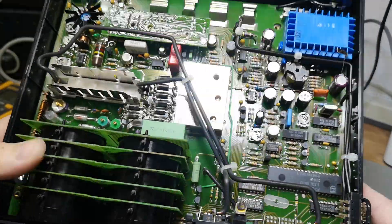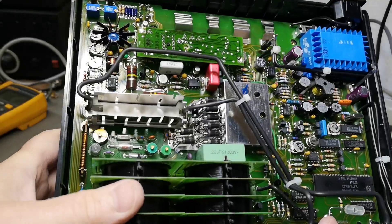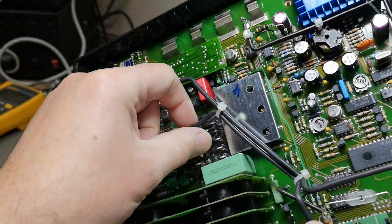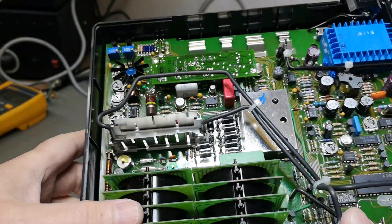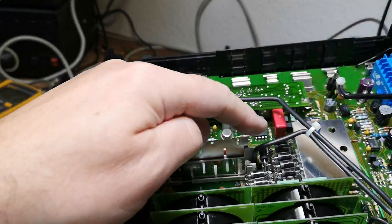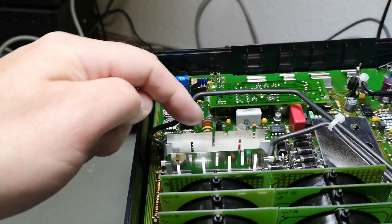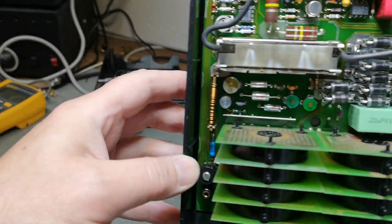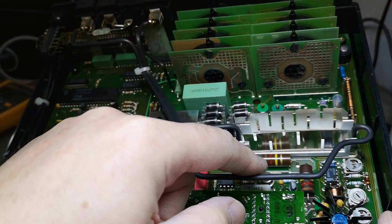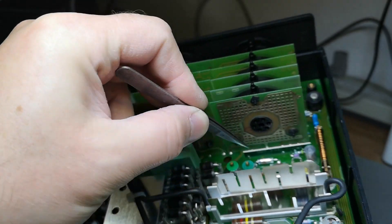It is really really beautifully made. I'm actually impressed — this looks like heavy-duty high-current construction. This one can do 20 amps. And look at all those diodes — I can't remember seeing that before. And look at the high-current sense resistors — we've got a lot of different ones. And there's also a special voltage divider.